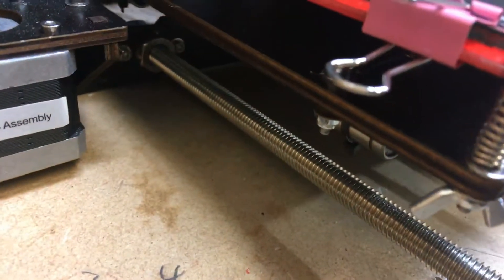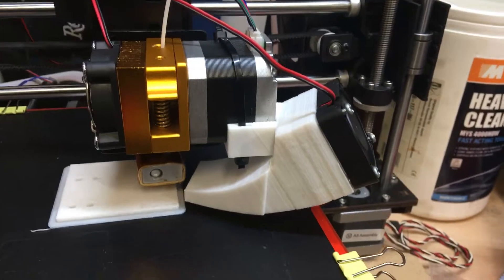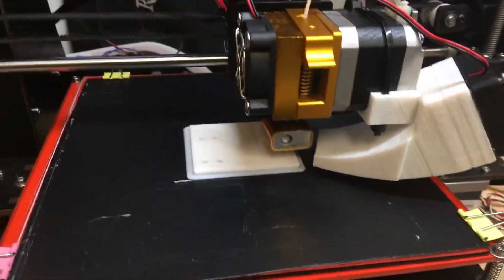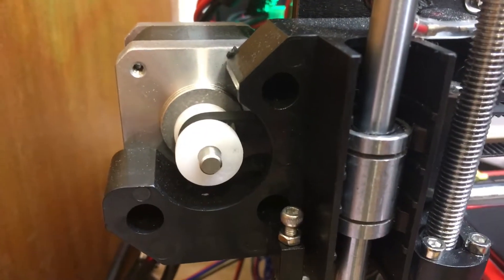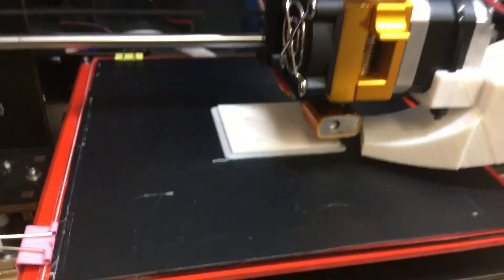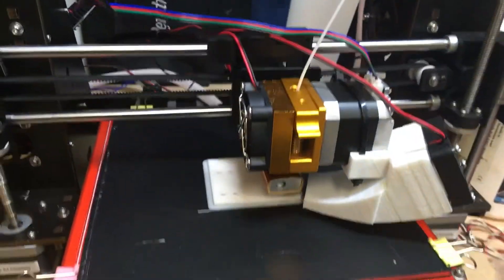Another tip: when putting this machine together, do put the nuts on to secure the XY axis to the main frame. Definitely print yourself the V8 fan — just zip ties on, really useful, dramatically improves print quality. I've got another problem: this idler for the drive pulley is not centered, so I have an enormous amount of twist in my belt. My print quality going across on this machine is rubbish at the moment, so I have a new set with belt tensioners and aluminium drive pulleys coming from eBay.